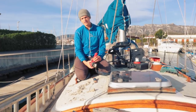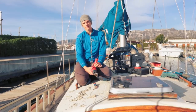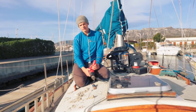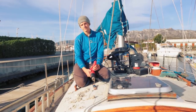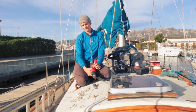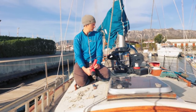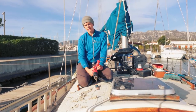The deck of the boat was originally covered in some sort of grit, coarser than sand. When it was first done it was probably really good, but over the years people have painted over it again and again, and there's a really thick layer of paint, so all of that initial texture has completely gone. It's also quite heavy over a big area and it's relatively high up on the boat, so we don't really want all that weight up here if we can avoid it. We're going to take it off and just put a normal deck paint over, like an interdeck or something like that. But removing it is quite difficult — I have to use the heat gun and then the scraper, and it's really slow work. I think it'll probably total up to about 10 days of work just to scrape the paint off the top, and then we'll prime it and put the deck paint on top of that.